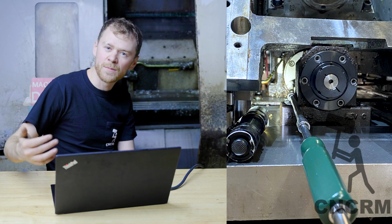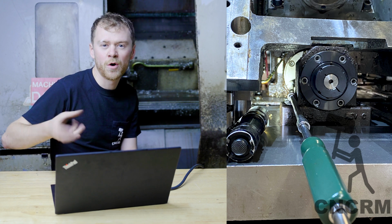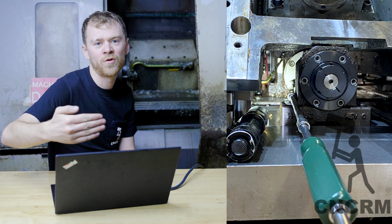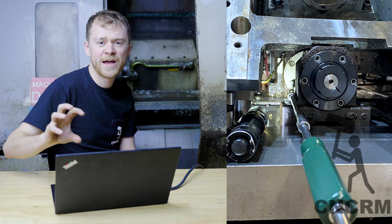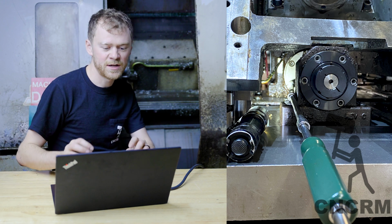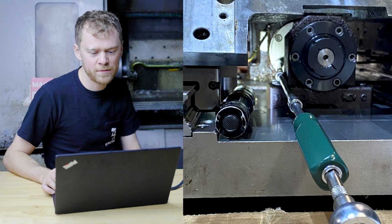Now I'm gonna float the ball screw in. I had the motor off so I could easily just grab and rotate the ball screw. And so I kind of pushed Y all the way back towards the motor, cinched down the ball nut. Then I kind of ran it forward, ran it back again, kind of floated it in to be sure it was aligned in the yoke. And then I cinched it down. There I am. You can just kind of reach around some of them.